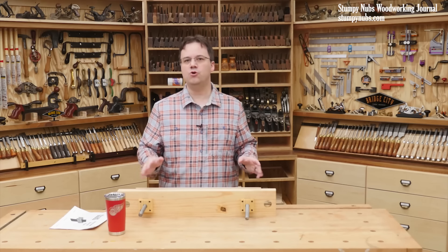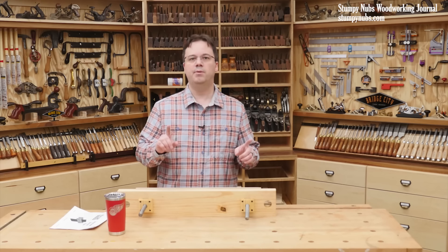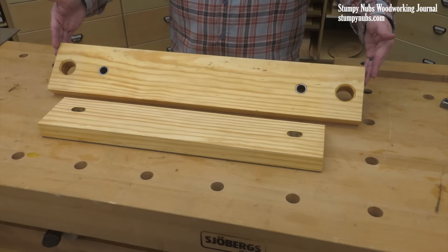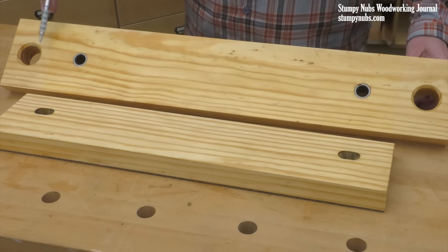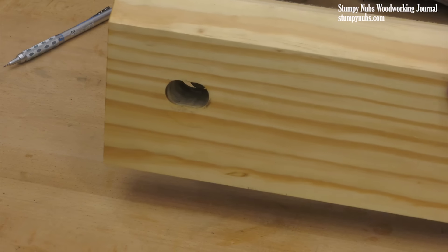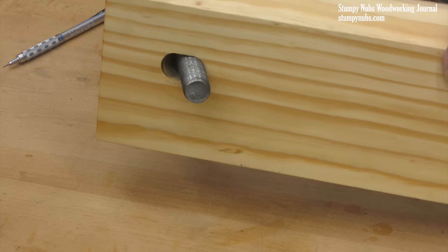There's no reason for me to show you every step in this build because it's all covered in the instructions, but let me show you some of the key highlights. You'll need a couple chunks of wood — the plans will tell you the dimensions. This is just construction lumber; it doesn't have to be anything fancy. Most of the holes you see are straightforward, but you'll notice two of them are elongated. This is done by simply boring two holes next to each other and then chiseling out the waste in between. The oval shape keeps the jaw from binding on the main screws.